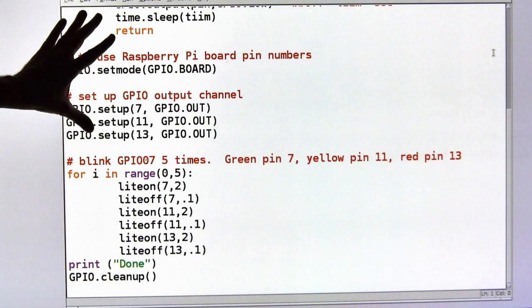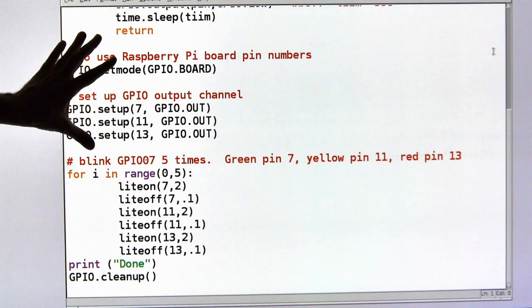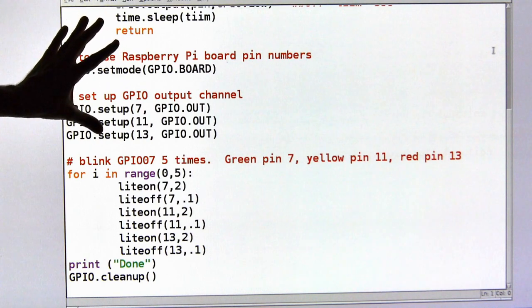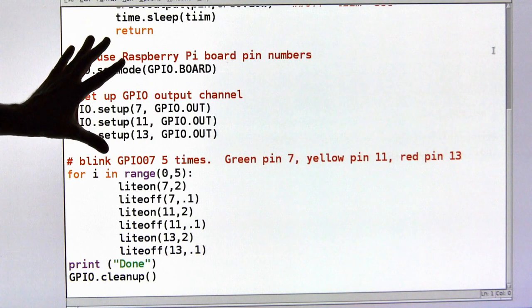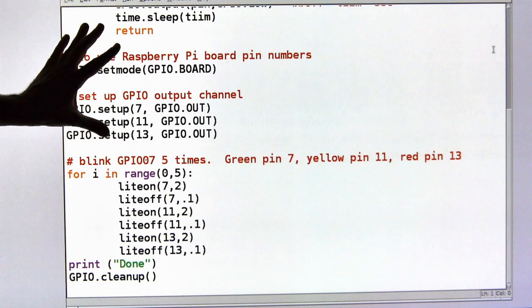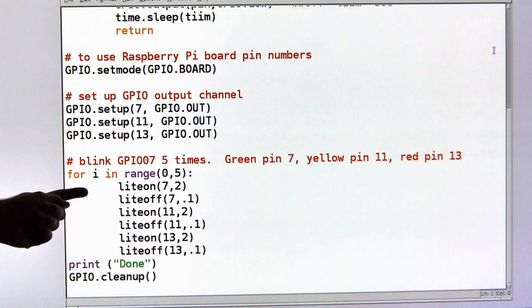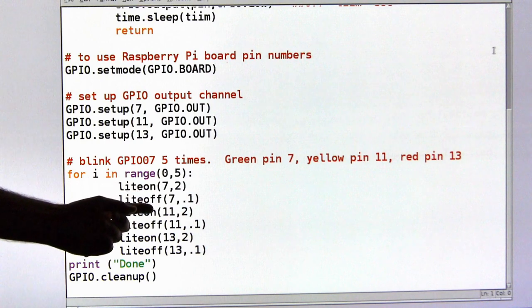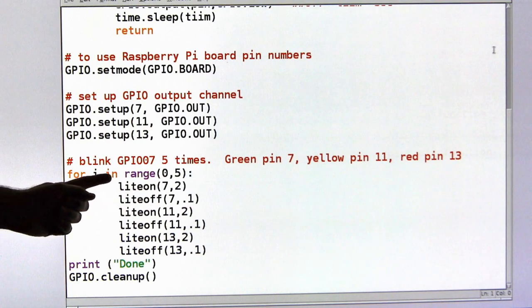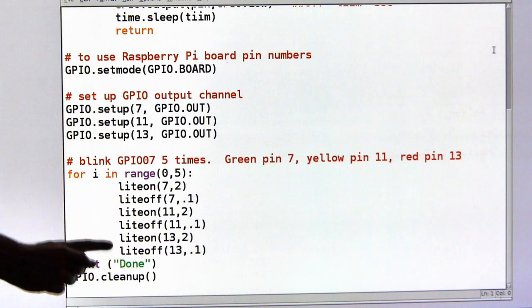And all of this up here is just setting up the situation. I haven't done any real operating yet. I haven't made any lights blink or anything yet. I've just set everything up so that the computer knows what it's supposed to do when I start the real functions. Okay, so when I come down here, I've got this loop, and I'm going to go from 1 to 5. It says 0 to 5, but it's going to loop 5 times before it quits, and it's going to execute all of this stuff that's been indented right in here, and it's going to do it 5 times,